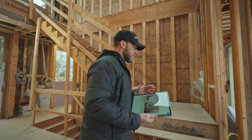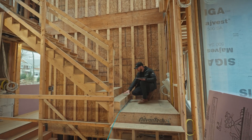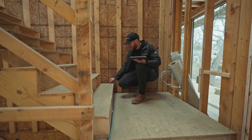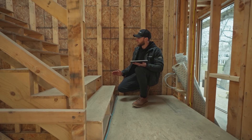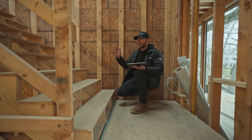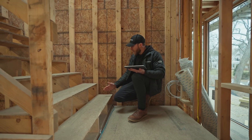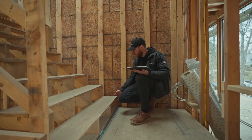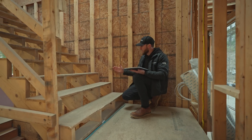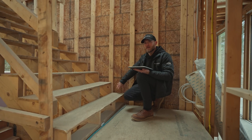The downside of doing that is that you don't have a skirt on the wall here. When you have a skirt you have a nice spot where that tread can come over and butt to it, and sometimes you can even have a mechanical fastening between the two materials. Where this tread is going to hit plaster it's going to be really difficult not only to get a tight joint but for that joint to stay tight over seasonal change — especially here in Massachusetts where you get cold and heat. So what we've actually detailed is the treads will stop about an eighth of an inch short, and there'll actually be a piece of black rubber to give you a really nice intentional shadow gap all the way up. Just an eighth of an inch gives you a little deflection and a nice consistent gap between the dissimilar materials — the white oak tread and the plaster.